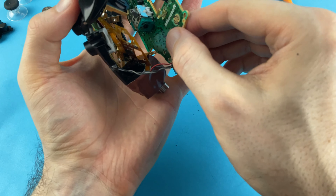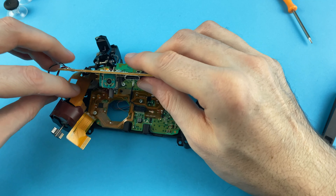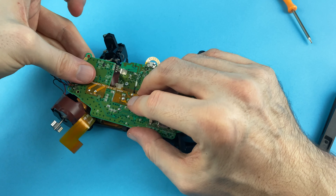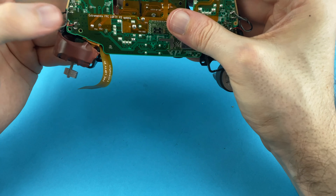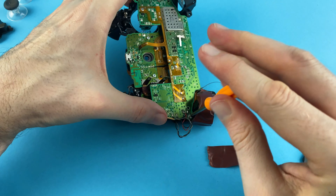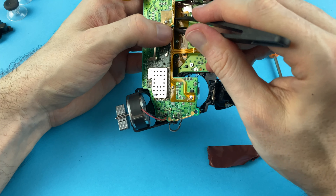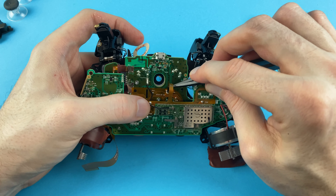We then have to put the first circuit board back into position and this is where things get extra fiddly. There's a bit of the DTF circuit board left over that we have to stick to this second circuit board, but you don't have much space between the two so be really careful and make sure you get it in the right place. You then put the audio jack back in — make sure all of the little gold prongs are facing upwards. Then snap the circuit board back into position, take your two screws and put them back in place, and reconnect the two circuit boards using the small black cable. If you have a lofty remap kit you'll also need to add this extra ribbon cable to join the two circuit boards together.